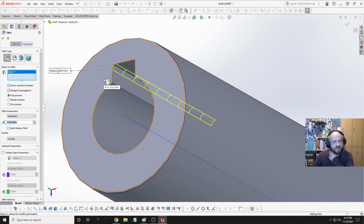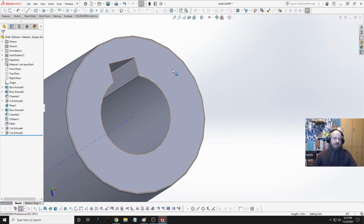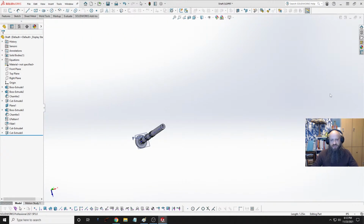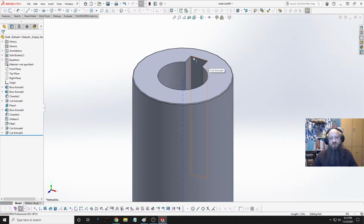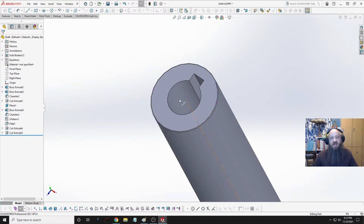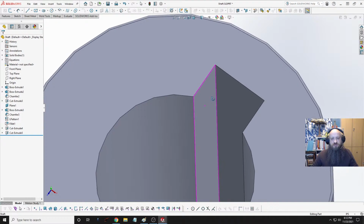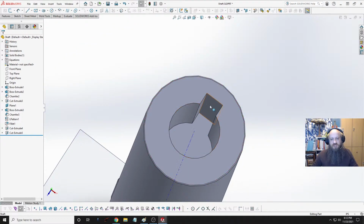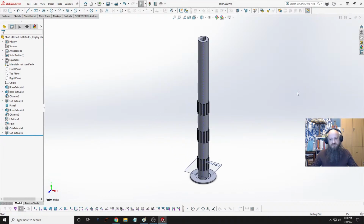Let's see if that's too much. No, because I really want it to lock into place. They'll probably deburr any sharps or anything like that, which is pretty standard in manufacturing. The tool that they use to cut this out will have a slight curve there, but it'll be generally smaller than what I would put if I put a dimension on there or a fillet. Then they would have to try and tool something for that purpose. So it's better to just do it this way, leave it, and whatever tools they have that does it will do the trick.